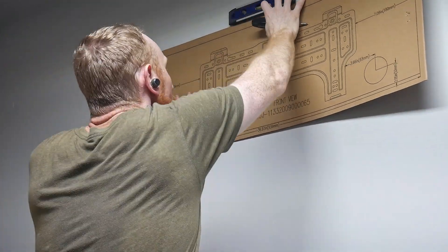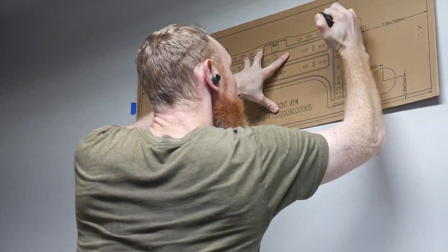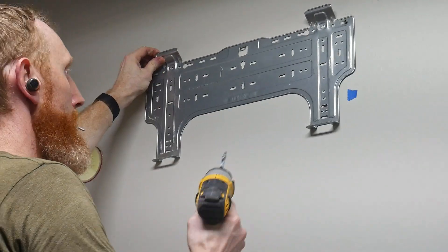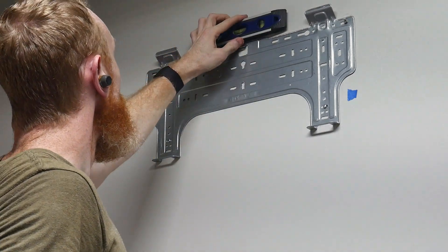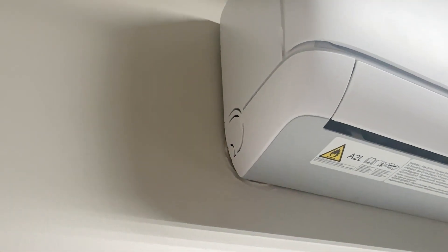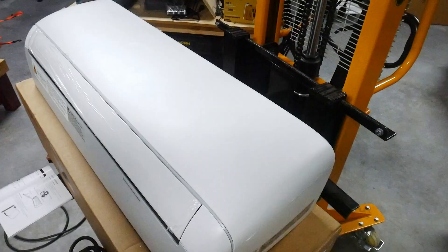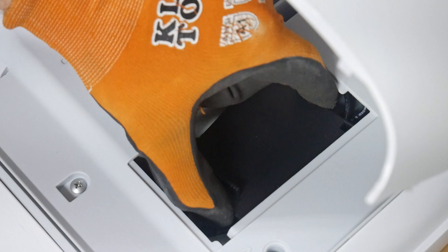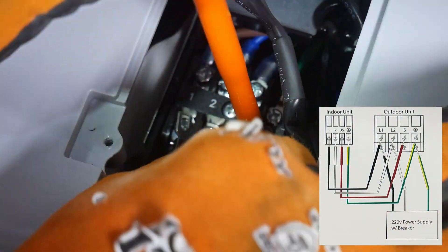Using the provided template from Della, I lined up my hole and transferred drill points onto the wall, trying to align with studs for the strongest hold. I should have offset the template a little more to the left since my 3.5-inch hole is larger than the hole required on the template. This resulted in being able to see some of the hole edges when looking up at the unit after install — not a big deal, but irritating from a fit-and-finish perspective. Wiring the inside unit is very straightforward, and there is a clean wiring diagram provided.